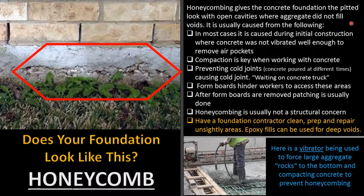When the truck doesn't get there in time, the concrete has already started to harden, and the second pour on top is called a cold joint. We try to eliminate that on the job — if it's more than 20 minutes, the truck is gone. Always do a slump test where you pour the concrete out, test it, and make sure the PSI is correct.